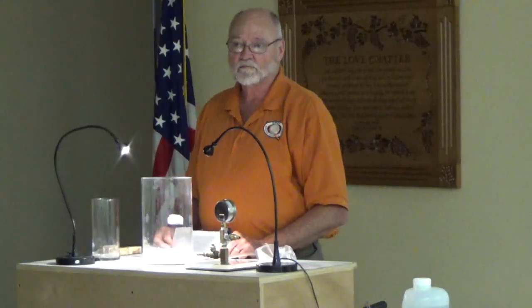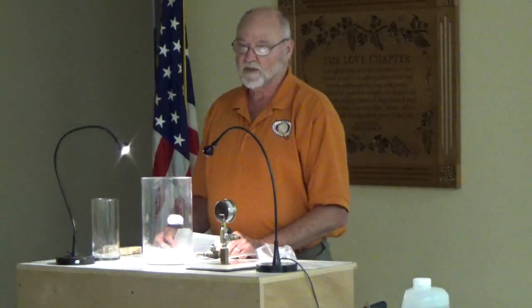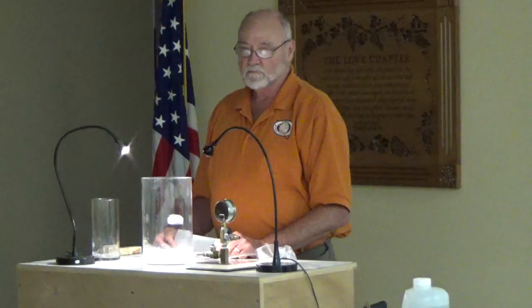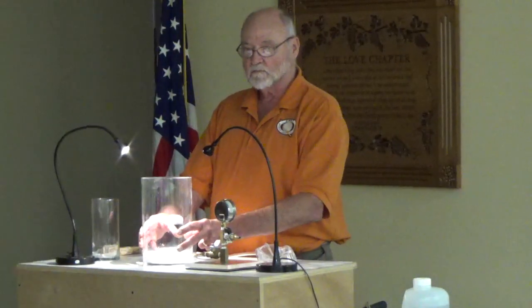Oily woods. Name some oily woods, guys. Any tropical, almost. Yeah. Cocobolo, woods like that do not stabilize. When you put this through the process, not only is the air gonna come out of the wood, but the oils are gonna come out. And it's gonna contaminate the resin that's in the tank with the blanks, and it won't cure.